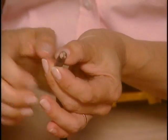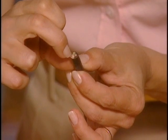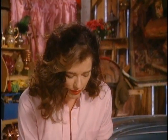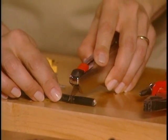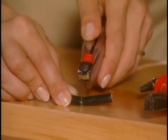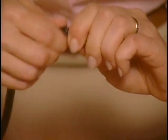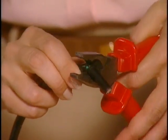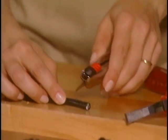So what we have to do is peel off the outside layer of insulation — that will expose the three insulated inside wires. Go with the utility knife, put it down on a hard surface, and roll the utility knife back and forth, trying to split that wire. It's just really easy to cut too deep, and then you have bitten into the inside insulation on one of the three wires. Once you hit copper, you've got to start over again, because it's not safe to have the copper exposed in a connection that's happening farther along the wire. So just start over and go until you get it right.